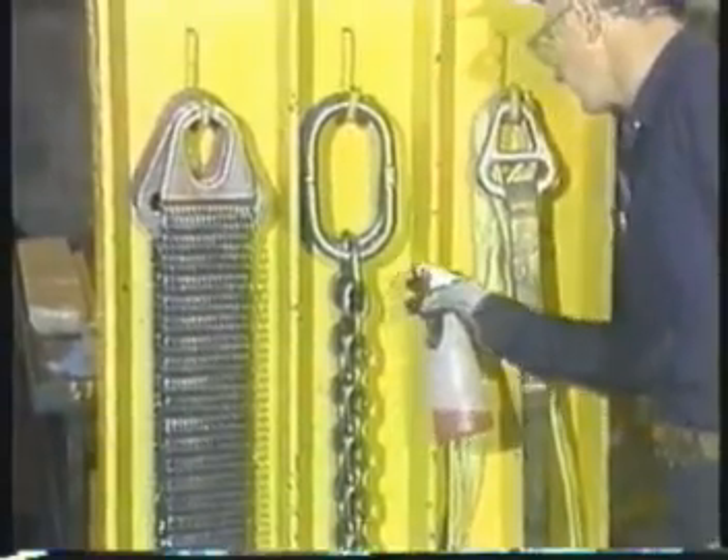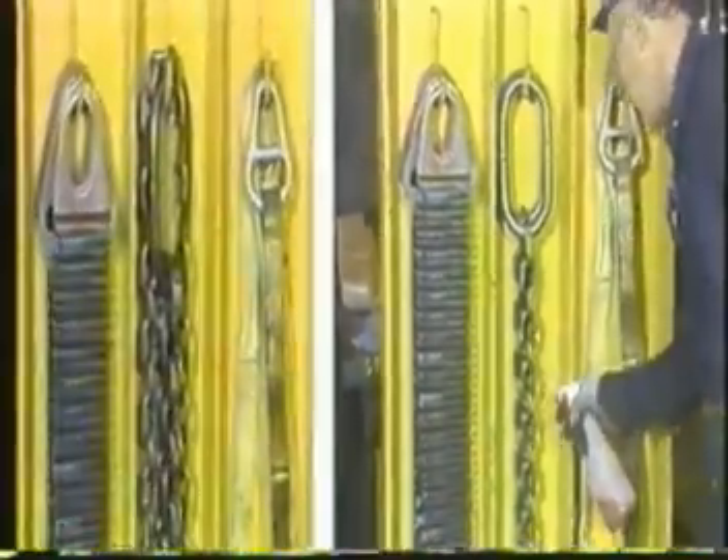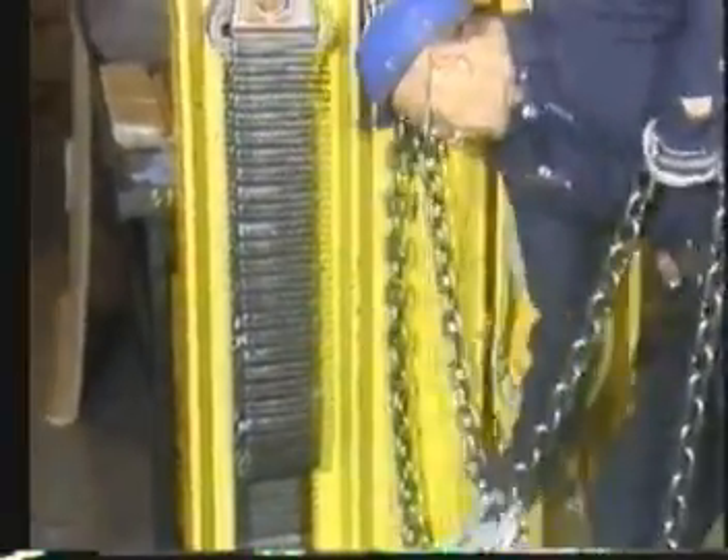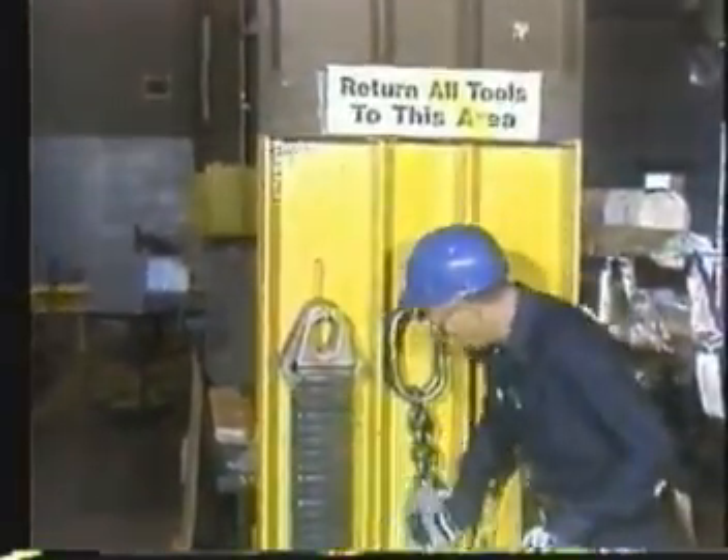Like any other material, chain can be damaged by the impact of something dropping on it. When the chain is not being used, do not leave it where anything heavy can fall on it or crush it. One small crack can open the chain the next time it is used. Any time a chain is going to be stored for even a few days, it should be oiled first for protection against corrosion. But when you take the chain out of storage, wipe the oil off before you use it again. An oily chain is slippery to handle — it can cause loads to shift, and it holds grit, which causes wear on the chain and on the load.